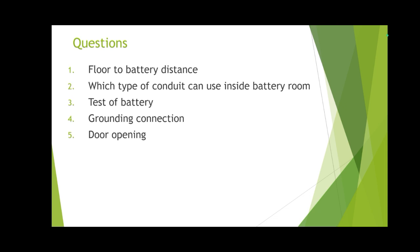Test of batteries: we check the electrolyte value, as already discussed in our videos. Second, we perform connection torqueing. Third, grounding — we perform continuity testing of the grounding and the bus bar continuity. And the battery electrolyte chemical value we have to check as well.